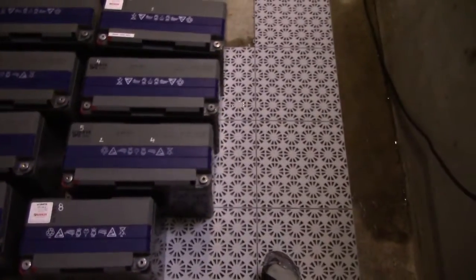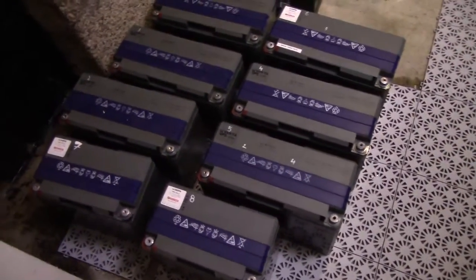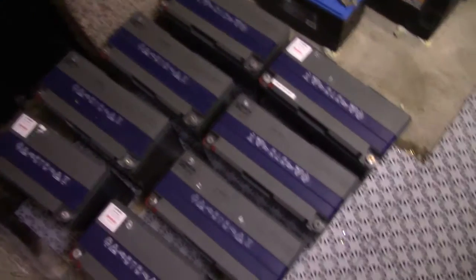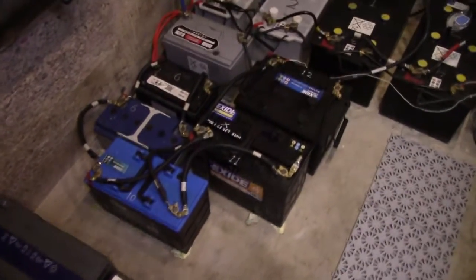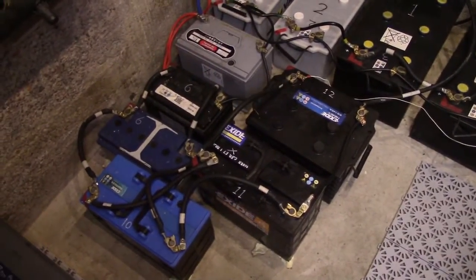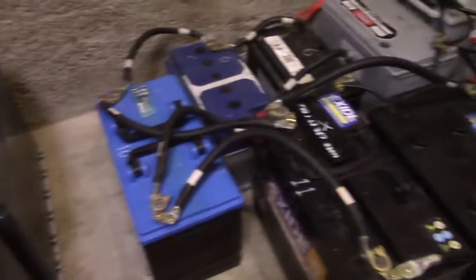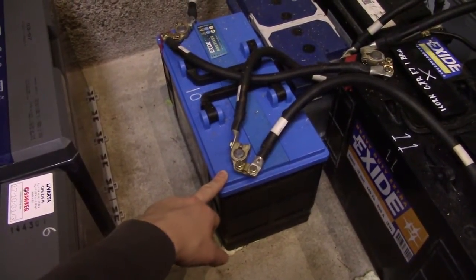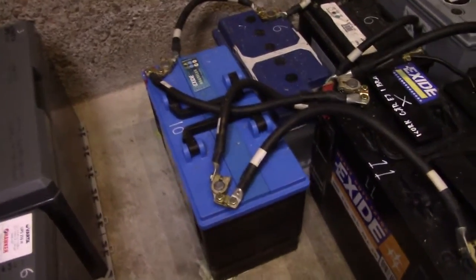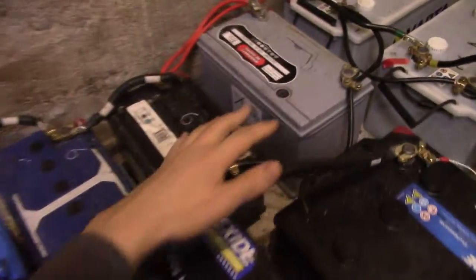This room is flooded as per usual, so I bought some tiles, which cost more than all the batteries combined, and I'm going to be installing these underneath the batteries as well. I'm also going to be ruling out a few of the less reliable parts in the current system, namely this one, because these seem to very often suffer from shorted cells—in a massively parallel system like this, that's something you absolutely want to avoid.